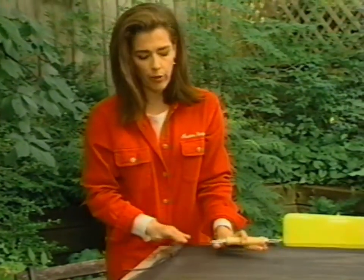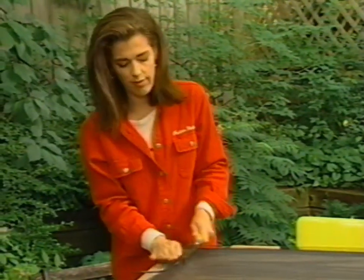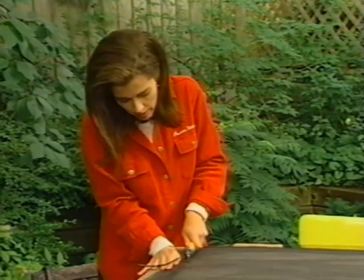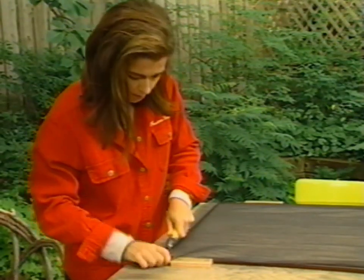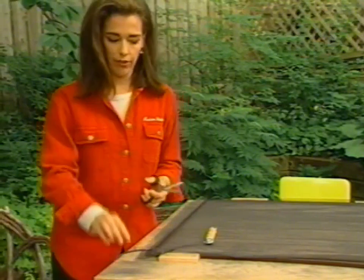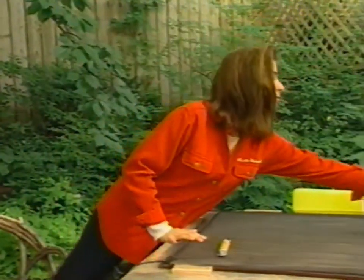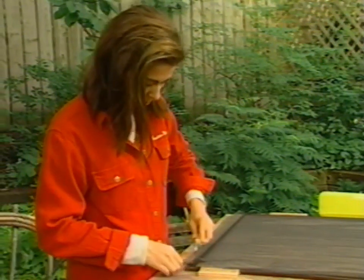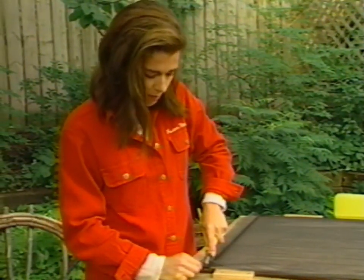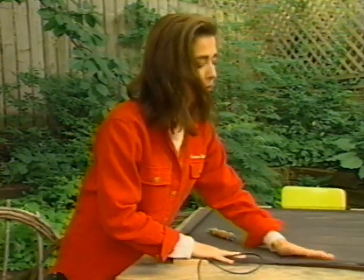Vinyl is kind of nice because it's stretchy, and where it's starting to pucker I can keep working the puckers out as I go around each of the four sides. So I come to half an inch from my next corner, grab the scissors and cut off another diagonal piece of screening so that I don't have a puckery corner. Executing the corner now — this is where you have to really start paying attention to puckers that might be occurring in your screening.